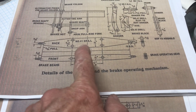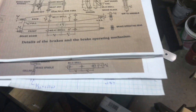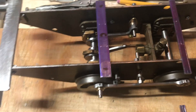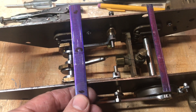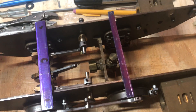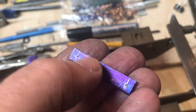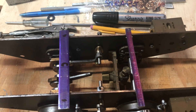I wanted to make the brake beams — there are two big ones that go across and then a rear one that's like a little pull bar. I'm making all these out of eighth-inch by half-inch steel. I used the belt sander to clean off the scale, then blued it with a Sharpie marker and marked them out. The large one just needs holes drilled; the two smaller ones need to be milled down to quarter-inch size, and the ends need to be turned in the lathe so I can put a little nut on the end.